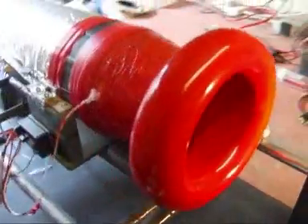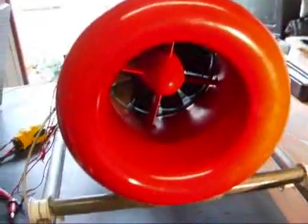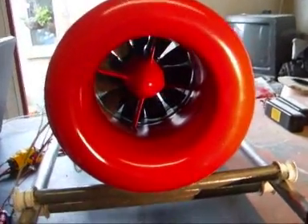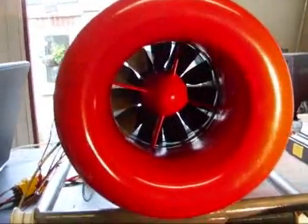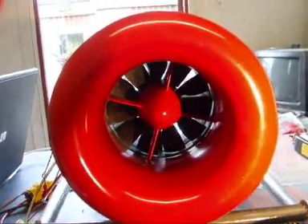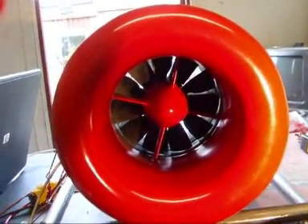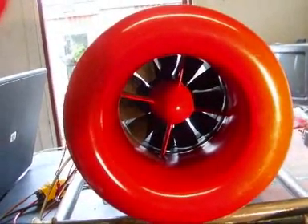What we've done for the test is produce a full fan swept area inlet which has a diameter of 104mm, and in there a centre body to maintain the FSA — that's fan swept area. The centre body also contains the RPM sensor for the Eagle Tree unit, which I've switched to the optical device. Unfortunately, the way I've created it, we seem to have an error up to about 28,000 RPM where it's doubling up.